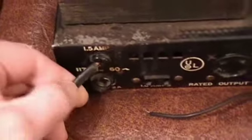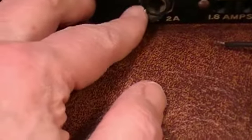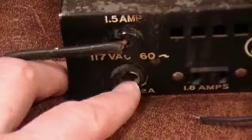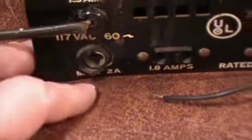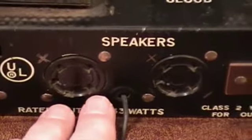I'll turn it around to show you why this should not be plugged in. Right here the wires have worn through and there are open bare wires underneath. The spot for a fuse — the fuse holder is broken right off, snapped off. There's no fuse or working fuse holder. Coming down here we have two spots for speakers but these are disconnected inside and do not work.